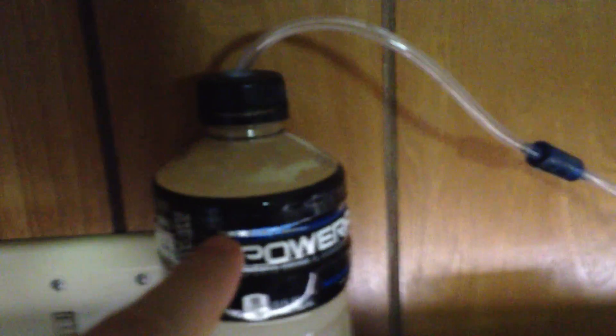That little blue thing is a one-way valve — it just means air and water can only go one way through the tank: that way, not that way. Which means that when this thing isn't generating pressure, water will come back up into the tube, and you don't want it to go past here and then there. So that's what that valve does — stop that from happening.